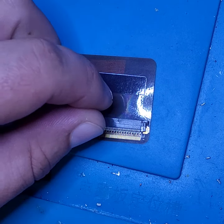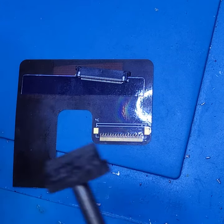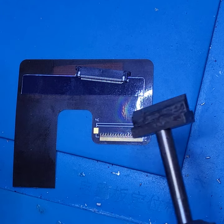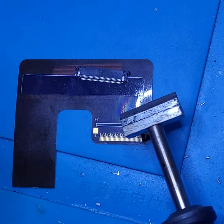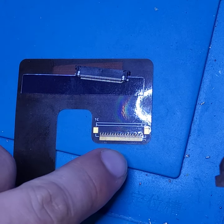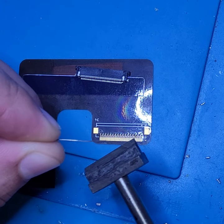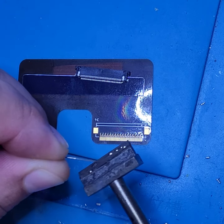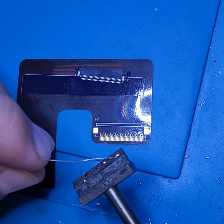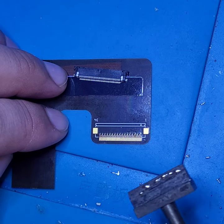This is a half-millimeter pitch — it's kind of a pain to normally do, but using the spatula tip, the T12-1403, we can do this super easy in one shot. When you have the gold plating like this, what I'd like to do is add some solder to the pins first. It just makes things so much easier. Let's put some solder on the tip.